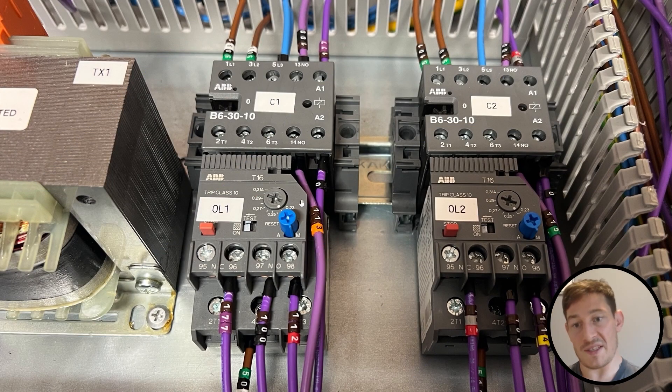A quick overview from this image: you've got the single phase coming in on L2, going out and then back around into L1. We've got neutral just on L3. This isn't wired yet because it's going off to the terminal block — that will be coming out of T1 off to the terminal block, and out of T3 off to the terminal block with the neutral. So that's the power going to the pump.